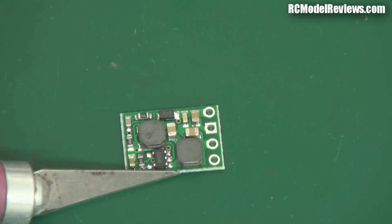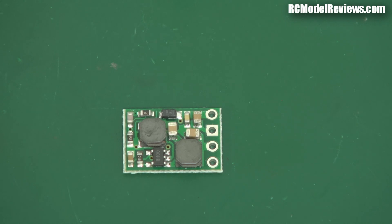The Pololu is really small and obviously won't do three and a half amps like the other one, but it's enough to drive a board camera, which is generally what you'd use it for when flying FPV. If you have a Sony 600 TV line camera that's only rated to operate at 12 volts, you need something to drop your 16 volts down to 12. And if you want to run a mini quad or plane on three or four cells, you really need the boost-buck, because a 12 volt camera can drop out when you get down to 9.9 or 9.5 volts. Without a boost-buck you could lose your video just as you're coming in to land. So now I'm going to put these on the bench and show you how they work, including how much ripple and noise comes out of them.